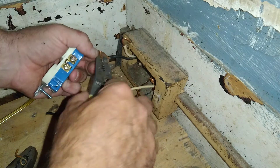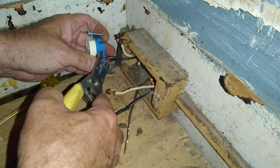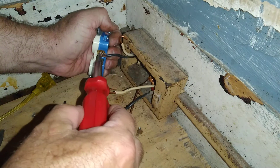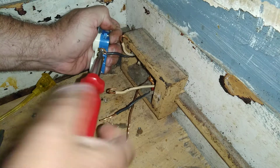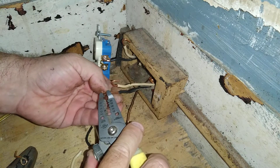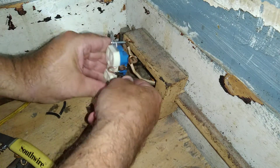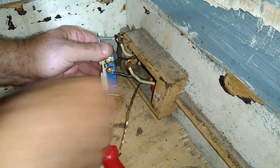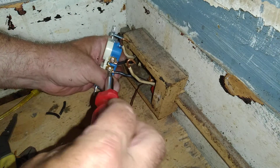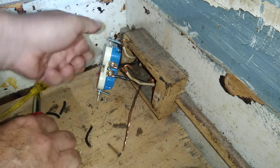We'll put the black ones on. We'll get the wire around the screw and close our loop around the screw. There's one wire, all right. But there's not enough room in the box to pigtail everything.